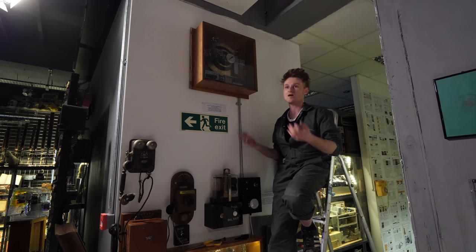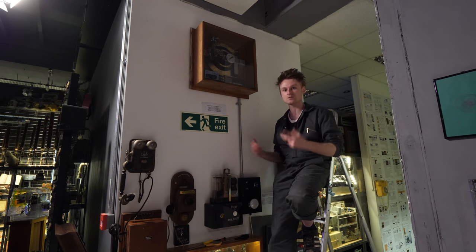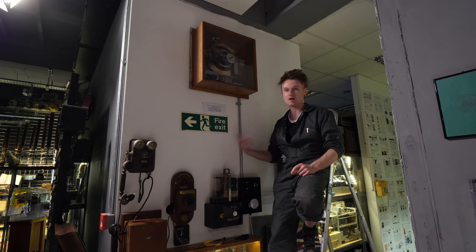The only downside is then you remove the gate to trigger effect that the two mercury switches are giving, and that is giving you an 8-second pulse to ring the bell. Without that, it's just going to send a pulse that is about 5 minutes long if you were on maximum speed.